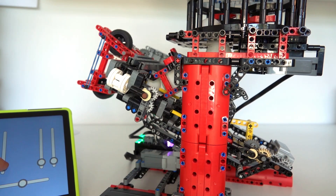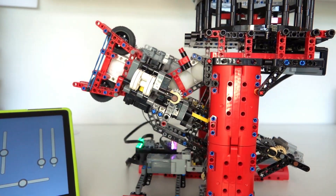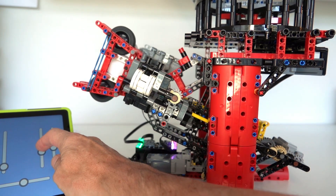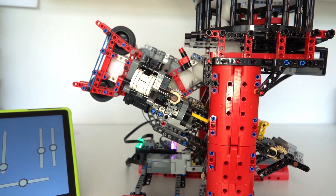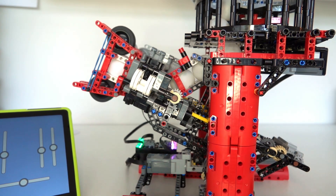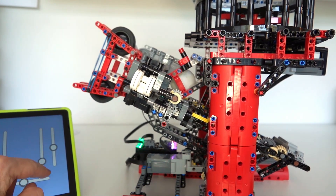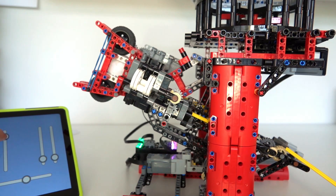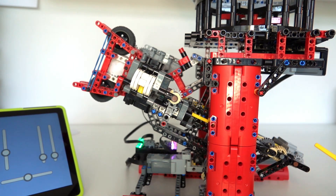Using the BooWiz app, I can start the feeder motor and you can see it pushing balls out the end of the launcher as they come down from the basket. With the launch motors also running, balls get launched continuously. The speed of launches per minute is controlled simply by the speed of the pushing mechanism — you can get about one ball per second at faster settings, down to one every two or three seconds at slower speeds.